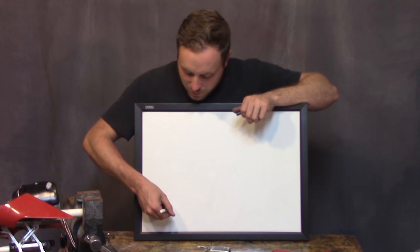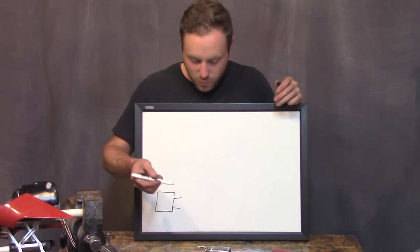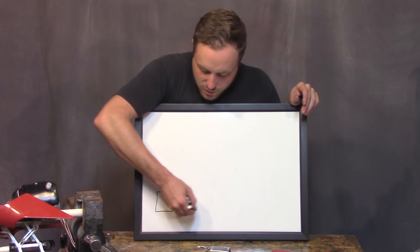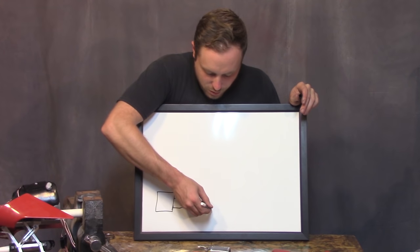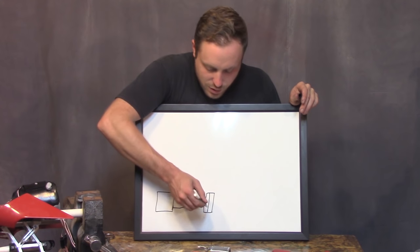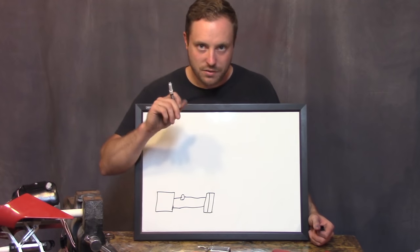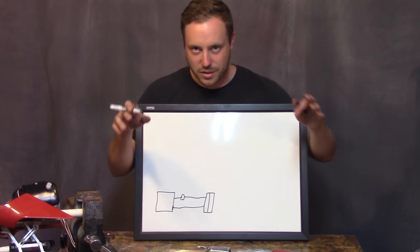The second system runs off of a second battery with power and ground wires. One will be interrupted by a master kill switch. Then those wires go to my two servo controllers, and those servo controllers decide whether the arms are in the up or down position — up position is closed, down position is open.